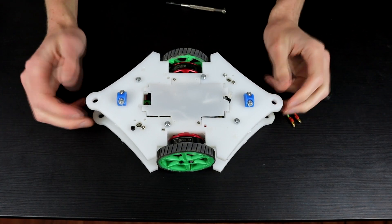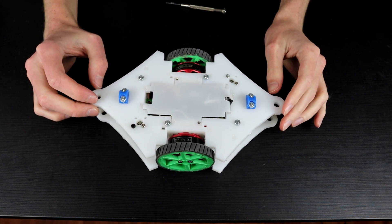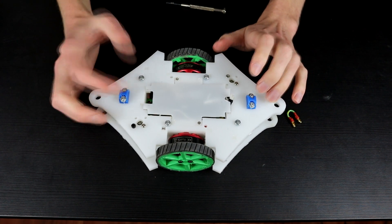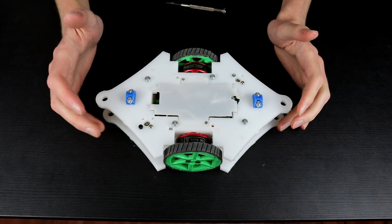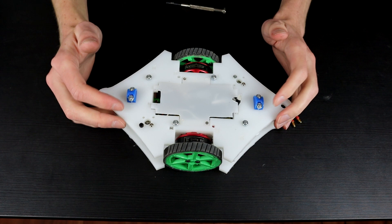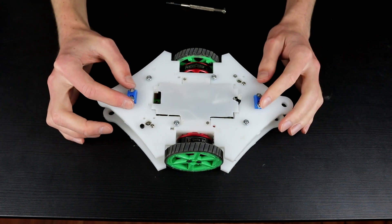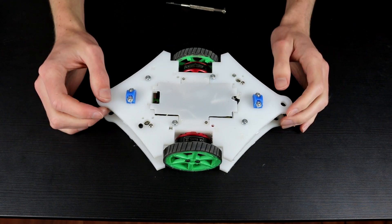So that was a test — things are interesting. We can get the melty to spin up and translate. However, the green light is the heading and the blue light is the demand position, and I was not getting translation in the direction of the demand position I was posturing. So I was getting a direction out of the melty, but not the one I wanted, which made driving difficult in the relatively tight space I have. That meant a lot of those tests had to be quite short.